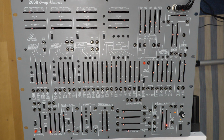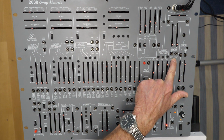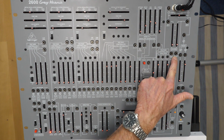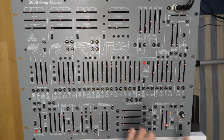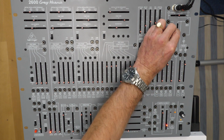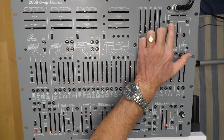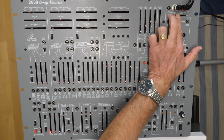the stereo reverb. The stereo effect is being achieved by phase inversion. So the left channel and the right channel are phase inverted, and that's according to the design of the original ARP 2600. Okay, anyway, so the next slot here is the reverb out. You can catch the reverb signal of the right channel and route it somewhere else. But here now I have the mixer output and the reverb, and that signal is being sent to the final outputs here. And you can pan the signal from left to right.